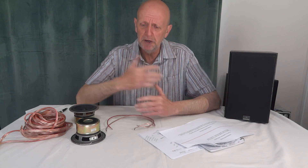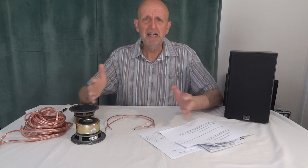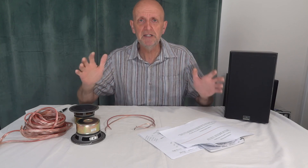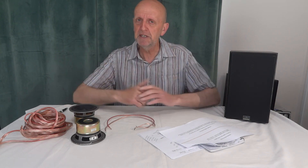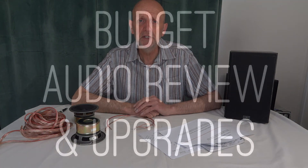I hope that video helped and you understood what I was trying to put across. Hopefully it's helped people thinking about wiring their hi-fi indoors in series or parallel, or adding an extra set of speakers to an amplifier that's only got one output - and the same applies to your car. For three or more sets of speakers, go online and use the impedance calculators to check you're within your amplifier's capabilities. Thanks for watching and I'll see you all soon.